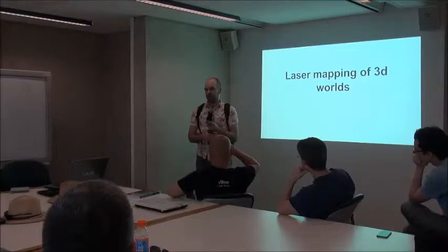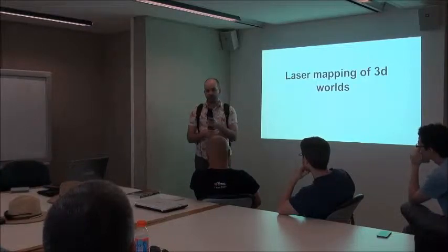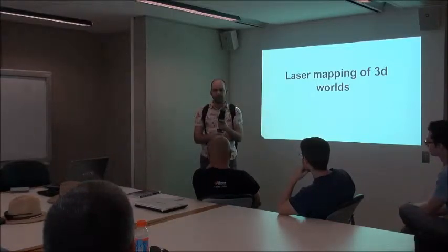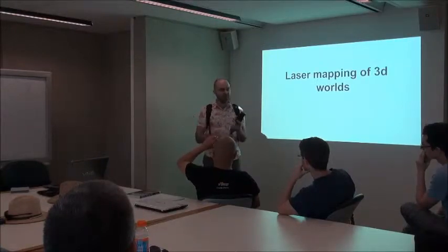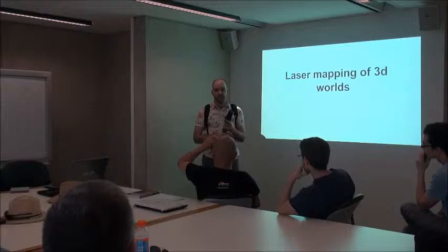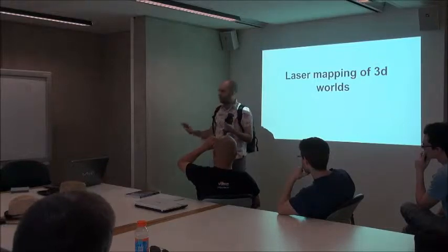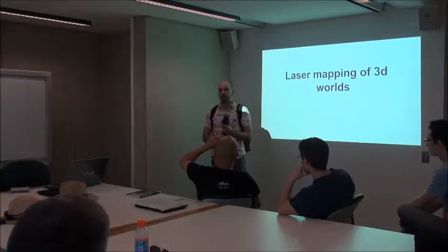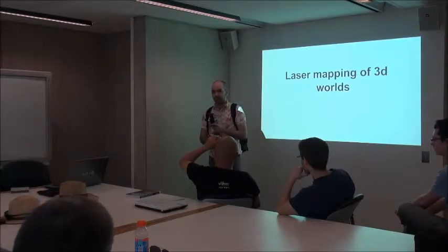Basically it uses a field called SLAM, which is simultaneous localisation and mapping, and instead of trying to use GPS satellites or compasses to work out where you are, you actually use the data that you're receiving about the environment. You make some assumptions, you assume that it's not moving, which is why I told a few of you to freeze when I took a map just at the start. We assume that the environment's not moving, we assume that the geometry has got some sort of surfaces to it, and based on that we do lots of complicated maths and come up with three-dimensional models.